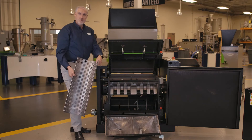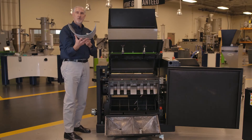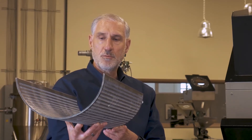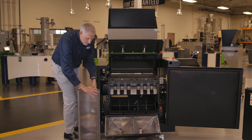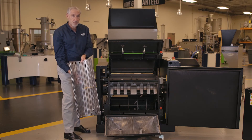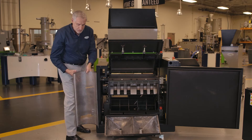The screen is easily removable. We have 50% rotor diameter coverage of the screen — you can see how the rotor completely wraps 50% of this screen. That screen area allows material to flow through very quickly, producing less dust and fines by reducing the residence time. We also have custom screens available, not only in different sizes but also high-wear type screens.